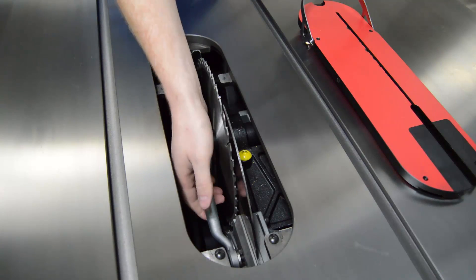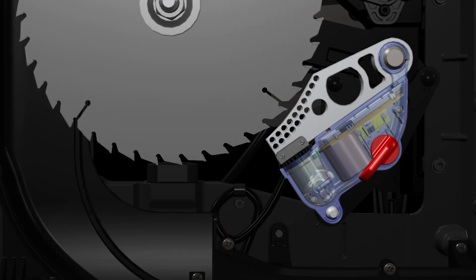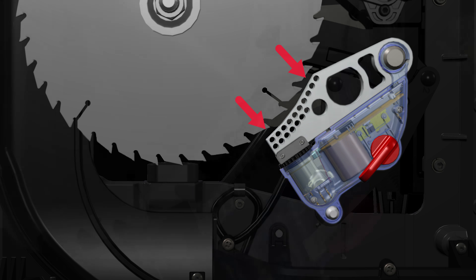Release the clamp handle to remove the blade guard or riving knife and set it aside as well. Next, check the spacing between the blade and the brake. Most of the time, the brake and blade will be spaced closer together at the top point of the brake compared to the bottom point of the brake, but you should always check the spacing at both points.